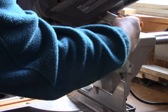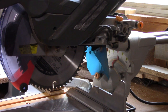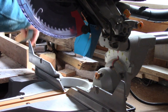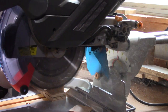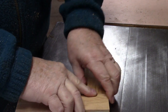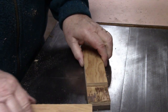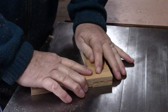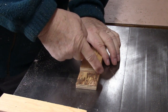At the chop saw I'm adjusting my depth of cut — just cutting that shoulder off a little bit further, like that. I need a sacrificial fence in back here. Okay, let's test them. That feels good there, feels good there — that's a good height. It's always a good idea when making cuts like that to test them on a piece of scrap. So I have my table saw set up to cut the cheek cut and my cross-cut saw to buzz that cheek off.